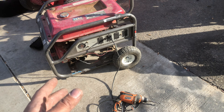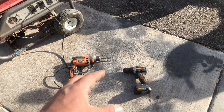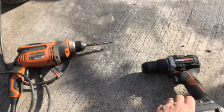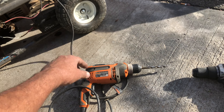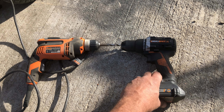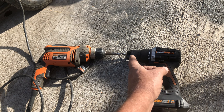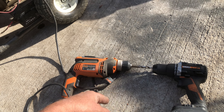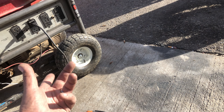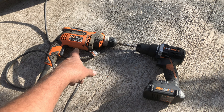So if you want to check, here's a nice little trick. The engine when it's running is too loud, so I'll demonstrate it in just a second. What I'm going to do is take this drill and connect it to the end of that bit, then bump it four or five times. After bumping it four or five times, it'll spin and produce a small amount of current backwards — back to the motor, to the stator, to the brushes — to try to excite it and turn it back on.